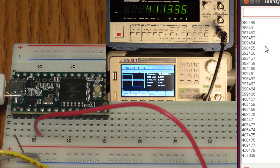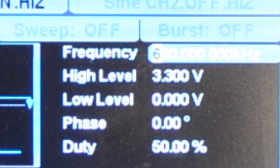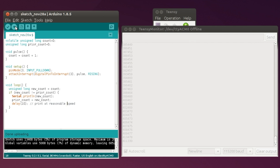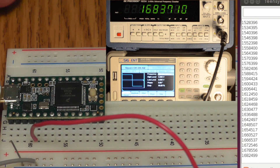Let's try increasing this. If we come over to the square wave frequency and try a much faster frequency — let's try 600 kHz, that's quite a bit quicker — we'll zero the frequency counter and zero the Arduino by uploading again. This probably will lose counts; this is probably too quick. And we can see that we got a much smaller count in the serial monitor, because it missed interrupts. It was doing other work and not able to keep up with the count.